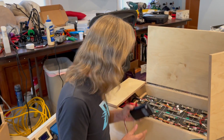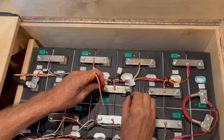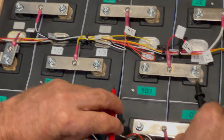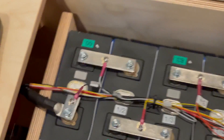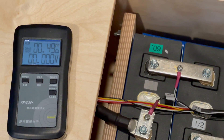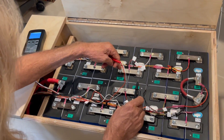Now if we come back to this brass bus bar, instead of 0.06 milliohms we have 0.18 milliohms. And instead of 0.21 milliohms terminal to terminal on the copper setup, here we have 0.49 milliohms. So you've got the additional resistance in the bus bar, and you're also not making as good a connection between the bus bar and the terminal.